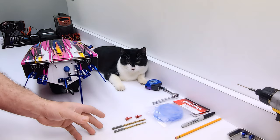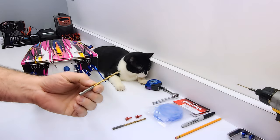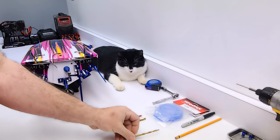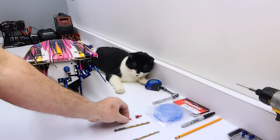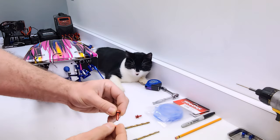The tools you're going to be needing is a 3/16ths drill bit, and this will be for your water lines — it fits the hole nice, it might need a little bit bigger size, I'm not sure yet, this is the first time doing this. And this bit here is a 7/32nds and that's going to drill the hole so we could thread these inlets here and the front part of the boat for the outlets.